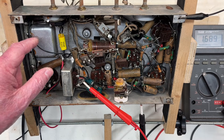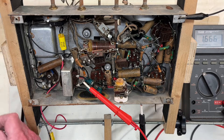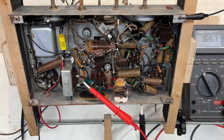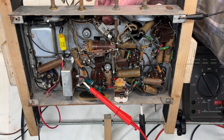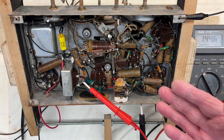Looking at DC voltage, so let me power this up. The dial lights right now are disconnected due to the resistor here — appears to be defective — so they will not light up. Let's power this up. Over to the left-hand side, try to bring this back in. 6-volt battery, 7-amp, powered and charged up. You can see our B+ voltage climbing, and I think somewhere around 138 to 140.